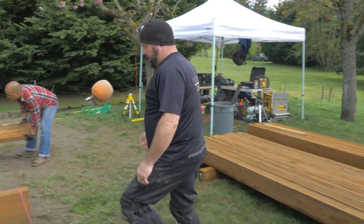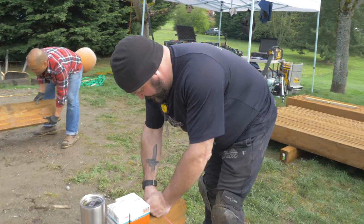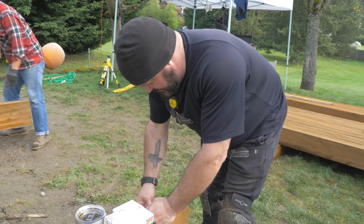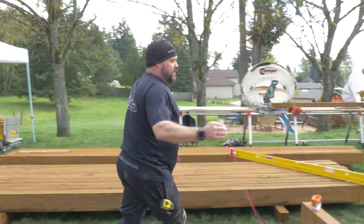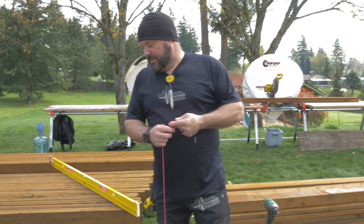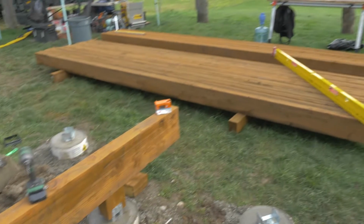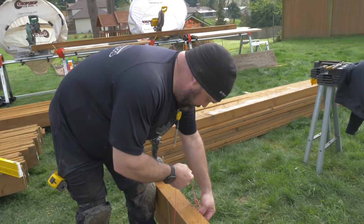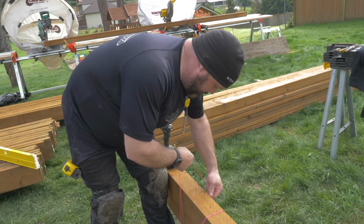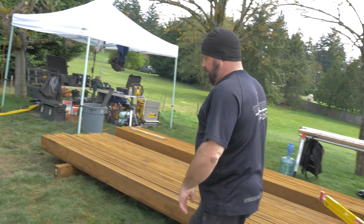So we got 3 of our 5 beams are set. Now we're gonna adjust elevation for the other side of the deck, and we're steamrolling right along. So good progress. We've got a couple small beams to put in along here. We're doing an octagon front to this deck, so those will go in after we get our main beam set to elevation. I'll start getting some layouts done, and Phil will start tacking joists together and things, and then I'll start figuring out where these go.